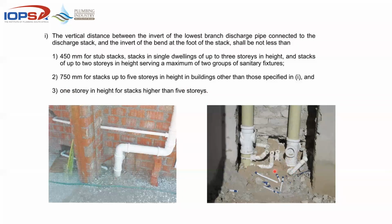So you can see in this case, on a normal 450 drain with that fitting sitting here, you've got top and bottom interconnected. Never mind all the other wrongdoings. We're just focusing on the fact that the invert of this fitting, the invert of that fitting and the invert of the drain, anything that flushes from the top will end up getting your stack or your traps to gargle and move around.